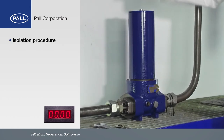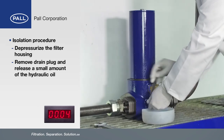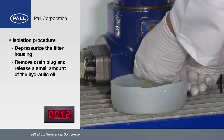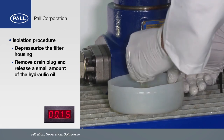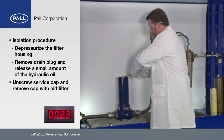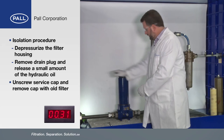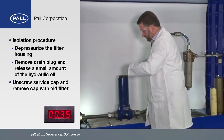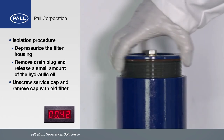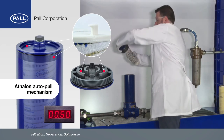As with the previous filter assembly, we've isolated the system, depressurised it, and now it's time to drain. We take a suitable container, place it under the drain, open it up — but this time we only need to take a small amount of oil out. Next, we grab a spanner and remove the cap. We simply unscrew the cap — already it seems a lot easier than the previous filter. This has a long thread, but we don't have the weight of the bowl, so by now I can take that off by hand and unscrew the cap, and we see how the lugs engage.